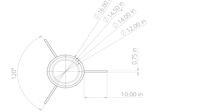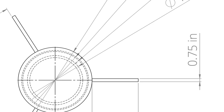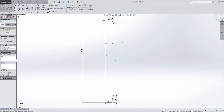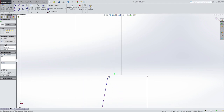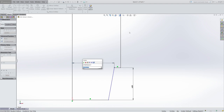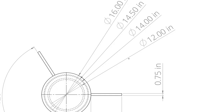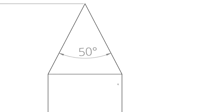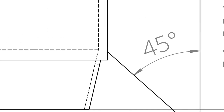Next I notice that I need diameters of 14 and a half, 14, and 12. If I look closely at these arrows, I see that the second line is 14 and a half. If you picture how this would actually look from the top, that second line is going to be the line created by the top of my nozzle, therefore I'm going to make that half of 14.5, which is 7.25. And then I'm going to make the bottom of my nozzle 12 inches in diameter, which would be a 6 inch radius. If you're having trouble recognizing the distinction between these hidden lines and look at it from the front, you can see that this edge of the nozzle is further out from the center than is the inside surface of the cutout. So the second line you see from the outside, from a top perspective, is that top of the nozzle.